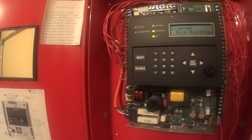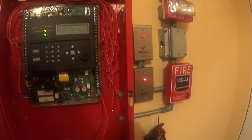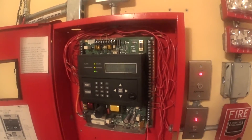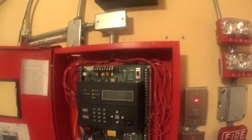And let's go to NAC2. If I'm correct — yeah, I'm correct — it's the LEDs on the key stations. I'm going to probably end up moving the LEDs to the second relay and make that a fire relay. I just have to research where the wiring goes in Relay 2. It'll be this right here, and it'll be NAC2, which will go right over here.